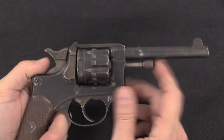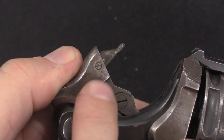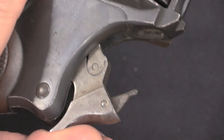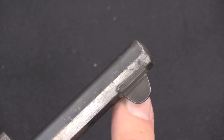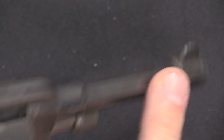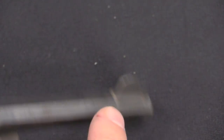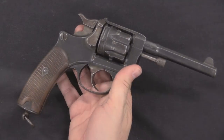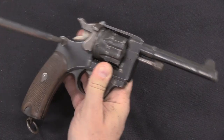The two main physical features that identify this as a civilian gun, aside from markings: first, this little screw that holds the firing pin in the hammer. On the military guns that is not a visible screw — it's a pin that is polished over. So if you see this obvious separate screw, that's a civilian gun. Second, the front sight is distinctive — you can clearly see it is a separate front sight dovetailed in place, a fin style. On the military guns, the front sight is forged into the barrel and is shaped like a lowercase 'i,' a vertical bar with a larger round peg on top. In general, the fit and finish of civilian guns were considered a bit inferior to the military ones.